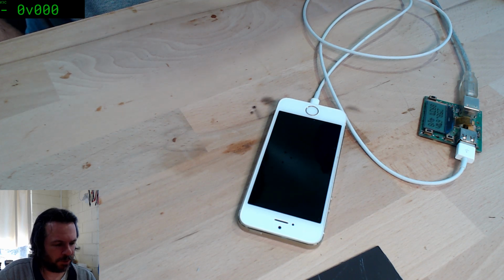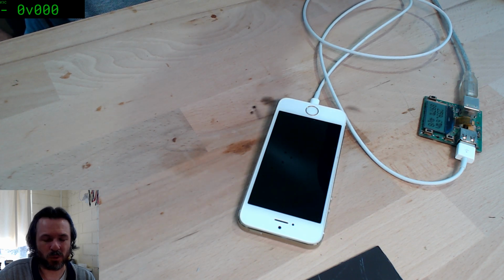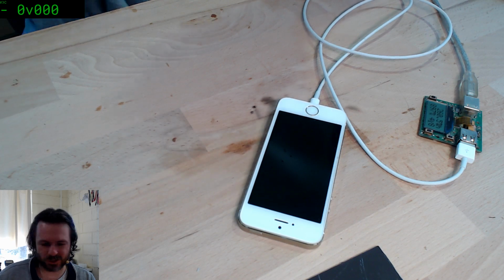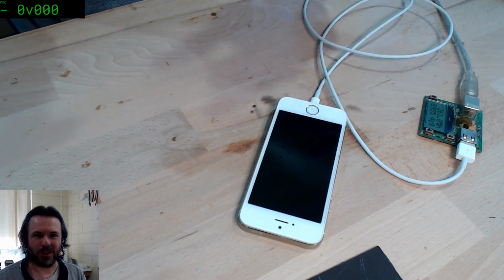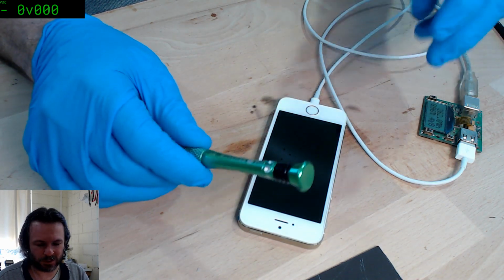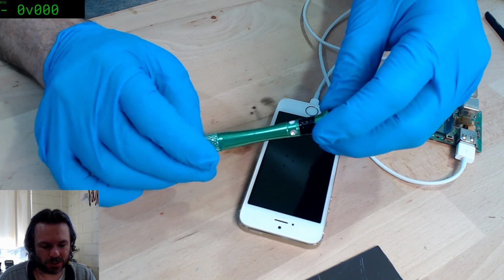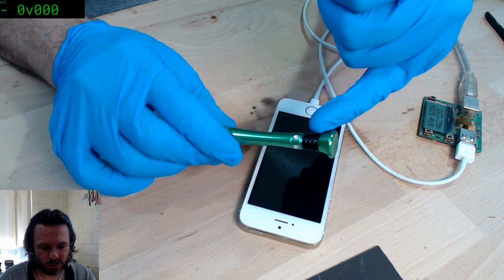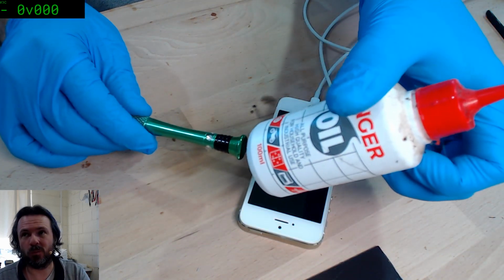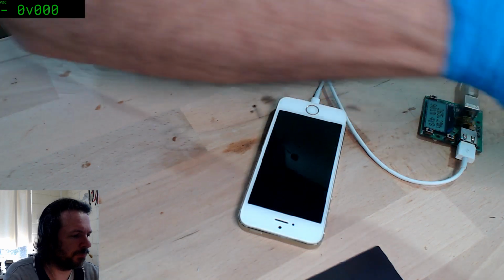Well, with the graphite, it's only a problem if it really pours out in large quantities. I think if it's just contained within the confines of just that groove there, it's not going to be a real problem at all. Also, graphite does tend to be a little bit stickier, particularly if you mix the graphite with the light oil, it really won't be going anywhere.